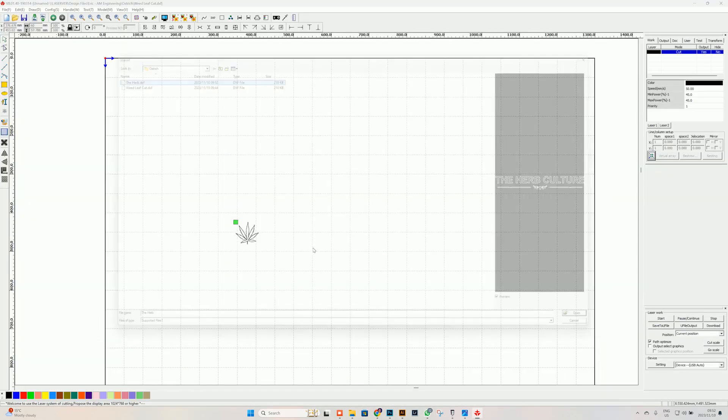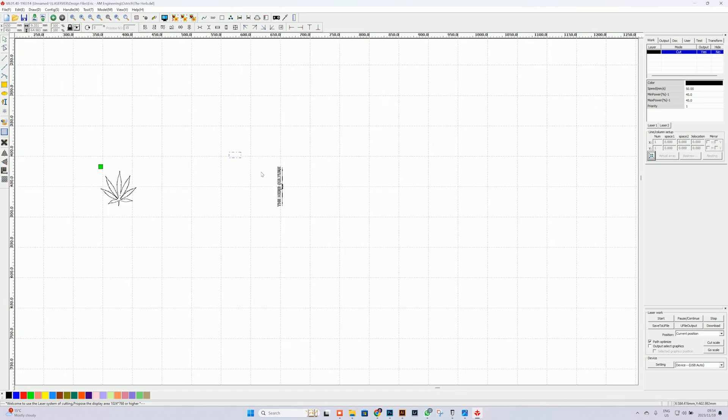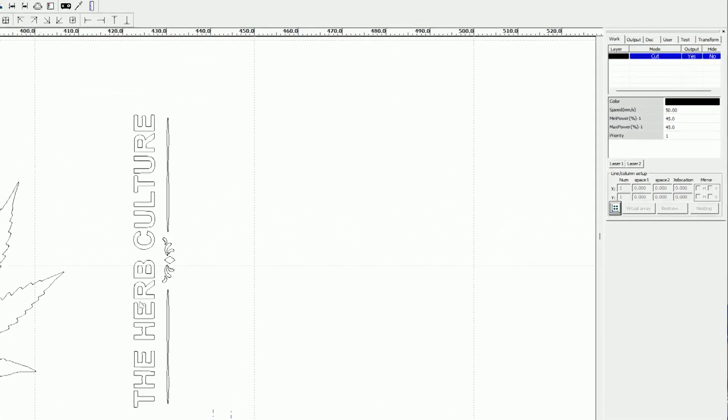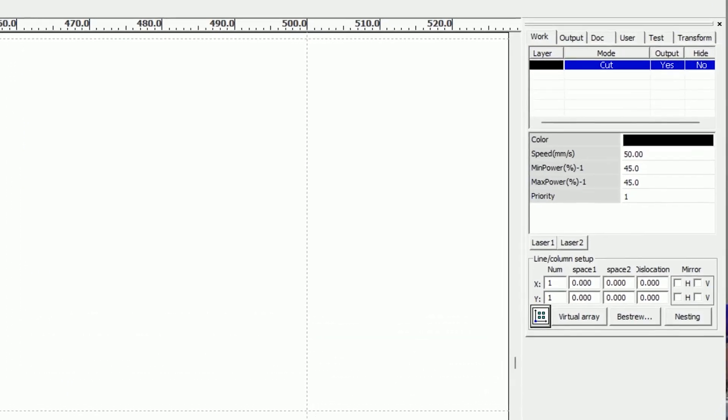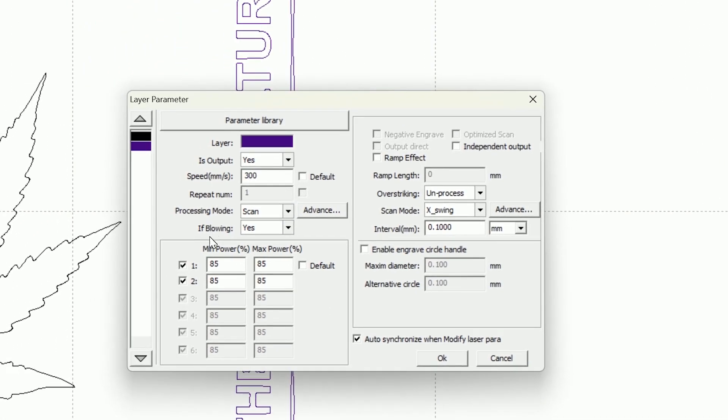Import our DXF. All we need to do is make sure we've selected our piece of artwork. I'm going to enter 90 degrees and turn it once. Once we've done that I'm going to change the color so we can see it's going to be engraving — I'll change it to purple and leave the other one black. For engraving settings, we're going to change it to scan instead of cut, leave it at 300 millimeters per second, and I'm going to do 35% power. I think the egg is fragile enough for that to be sufficient, but we are doing tests so we won't know until we try. Now we save it to our memory stick and head to the laser cutter.